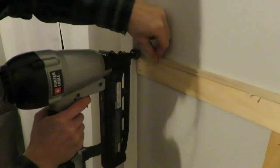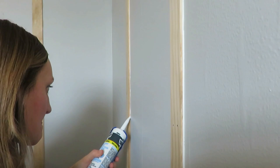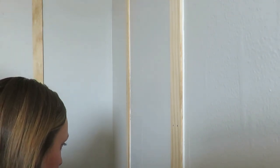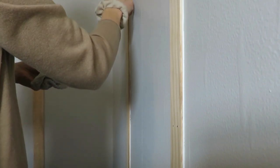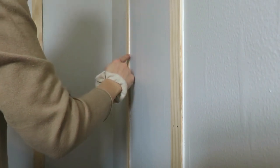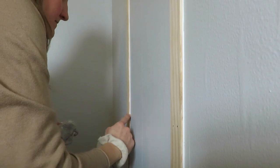The next step was to caulk. My husband showed me a great tip: less is more. Make a small bead along the edge of the wood and wall where you're filling gaps. Then wet your finger on a damp cloth and just wipe — don't put pressure, just gently wipe to seal it rather than removing the caulk. Keep your finger wet and it won't be messy at all. A lot of people say caulking is messy but it really doesn't have to be. Apply at an angle after you've cut the tip off your caulk gun.